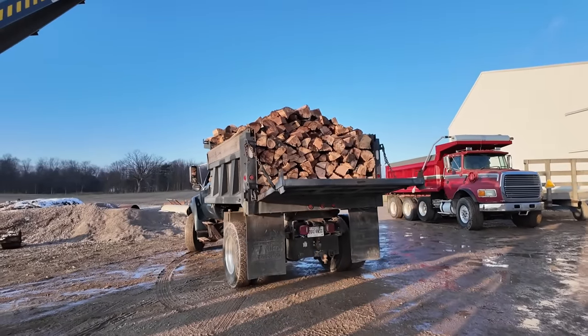I think this is the last big log we're going to be able to fit on this processor — we'll take the others home and do them at the axis; they're just a little too big. We've got a lot of logs we can run through that are smaller. On second thought, this one is a quarter of an inch too big. So we're going to pull that one off, switch the wedge out, and start running the smaller logs — the rest of them should all be pretty small, and the four-way wedge will work fine.